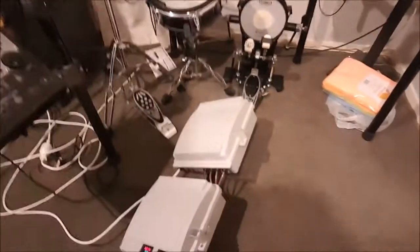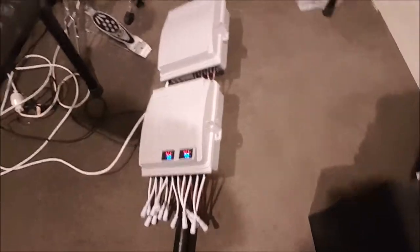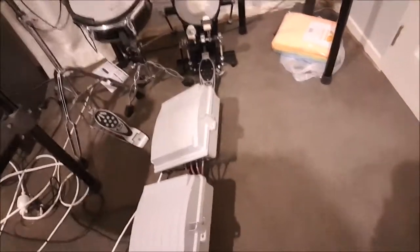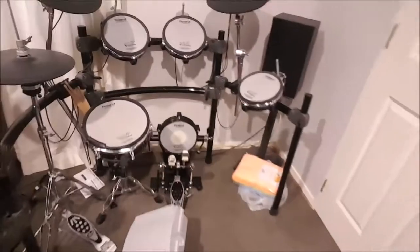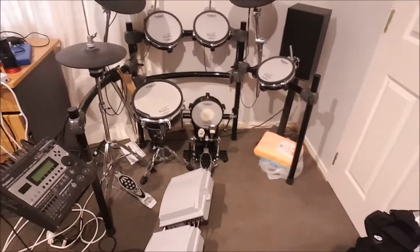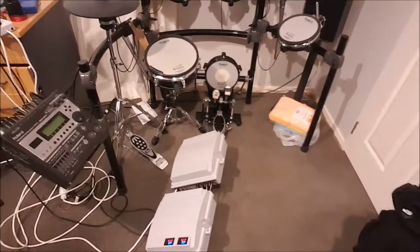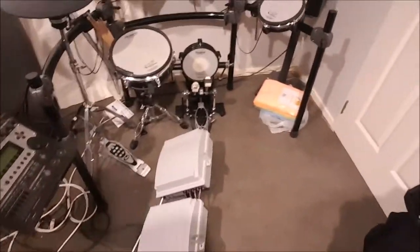Down here, this is one of the control units that I've built — just a piece of PVC pipe which I've painted black to make it blend into the scenery when it's mounted outside. A couple of cable guard boxes inside. In this case I've done 12-volt power supplies. I started out with 12-volt so I've stuck with it — you may choose 5-volt. There are some advantages around the runs you can do with 12-volt versus 5-volt without having to do power injection. I haven't bothered with power injection because I'm running on 12. It's slightly less efficient, but there are some pros that go with those cons.